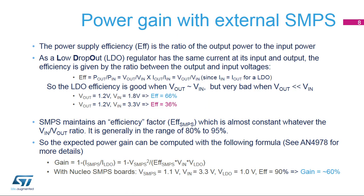The expected power gain with the external SMPS is directly linked to the power efficiency of the regulator. The STM32L4 microcontroller embeds low dropout regulators whose power efficiency is given by the ratio of the output voltage to the input voltage. When the output voltage is close to the input, the power efficiency is good, but can get worse as the input voltage increases. On the contrary, the SMPS power efficiency remains almost constant regardless of the voltage input ratio, generally between 80 and 95 percent, depending on its input voltage and current load. We can compute the expected power gain with the provided formula — see AN4978 for more details.